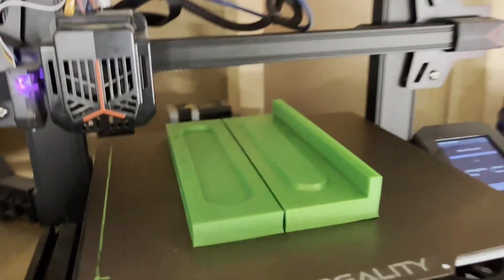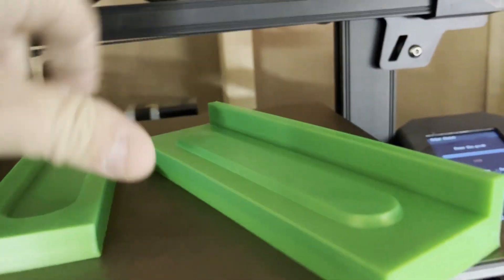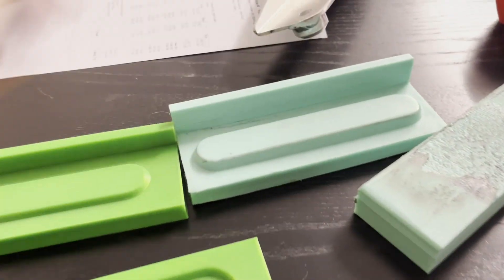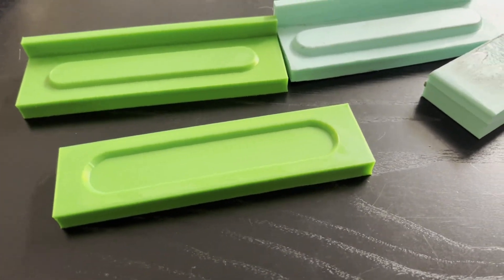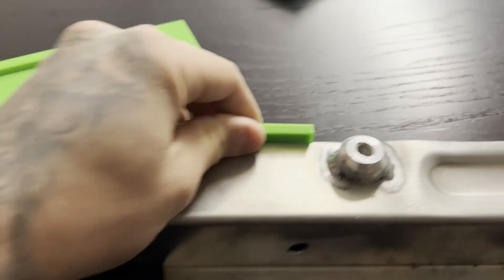The revised die is finished now. You can see the feature is a little bit less deep - it really doesn't need to be a quarter inch deep; an eighth of an inch is fine. This one came out perfectly flat. I left the heat on for the weekend, and you can see side by side how much deeper that feature is compared to this one. We're going to give that a go shortly on the actual piece, hoping it comes out a little bit sharper.